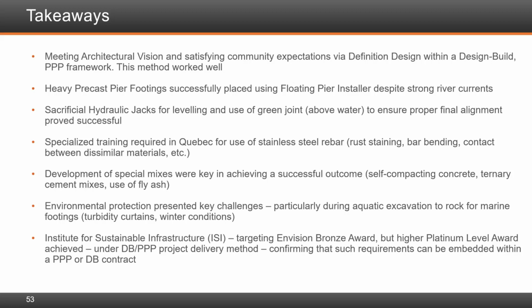Okay. We're concentrating on design questions right now, and we'll ask, first of all, what type of hydraulic modeling was used for the structure, and were there any concerns with scour potential around the piers? Yes, actually, three-dimensional hydraulic modeling was done for the river basin, and then that was used to do two things. One is to establish the current loading that we would see. Obviously, we have ice sheets that are there, and we were very interested in seeing what it would do to the loading on the piers.